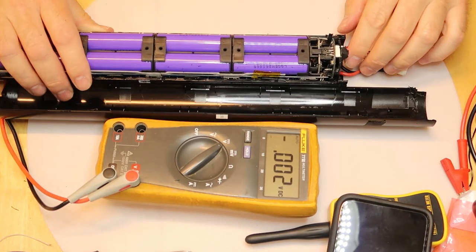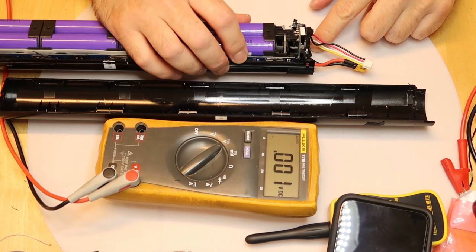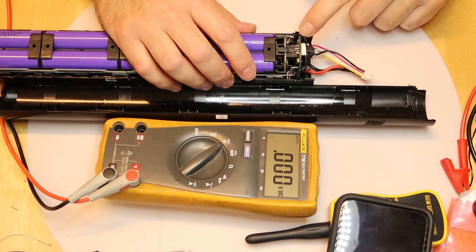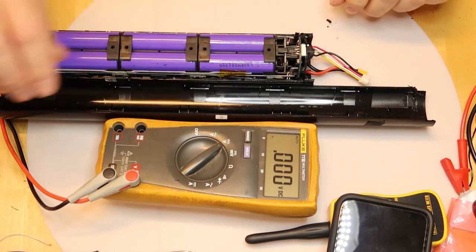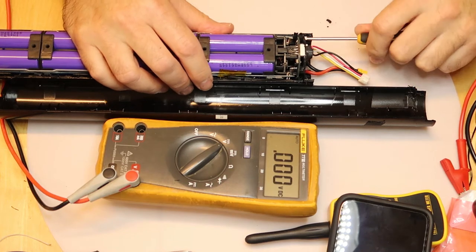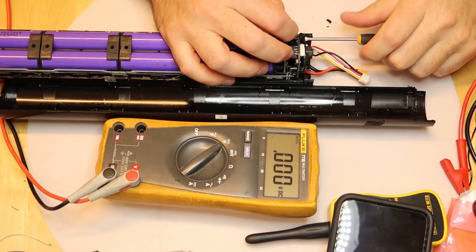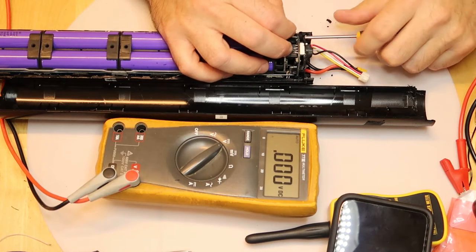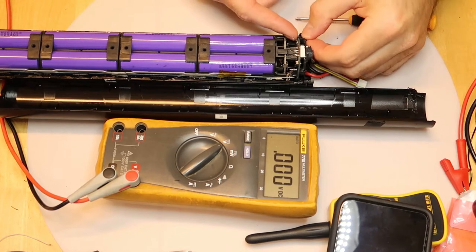Okay, so this is, you can see this is a plug. There are here two boards connected on each other, and in order to disassemble this one, I see there is a Phillips screw beneath the epoxy, and now that I know that it exists, we try to open it. It will be easier because everything is now cracked. So let's remove this screw out. Okay, I can now remove it.